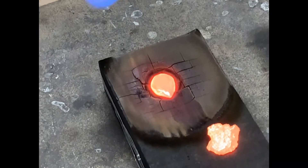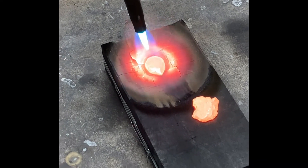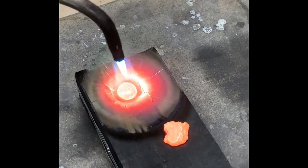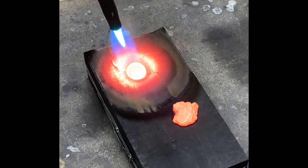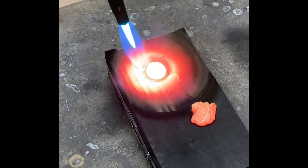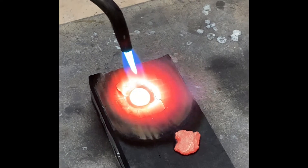So this is going to be our sheet. We don't have to alloy it again, but I'm just going to heat it up until it makes a nice blob. And this is one ounce, right? I made one side a little bigger because you said you wanted a little more wire. As soon as I turn the torch off, I'm going to grab the end of the charcoal block and we're just going to press this down a little bit. Then we'll flip the block over and I'll show you how to make the ingot.